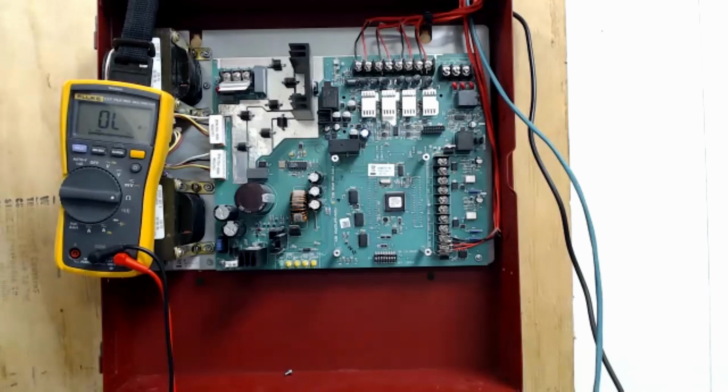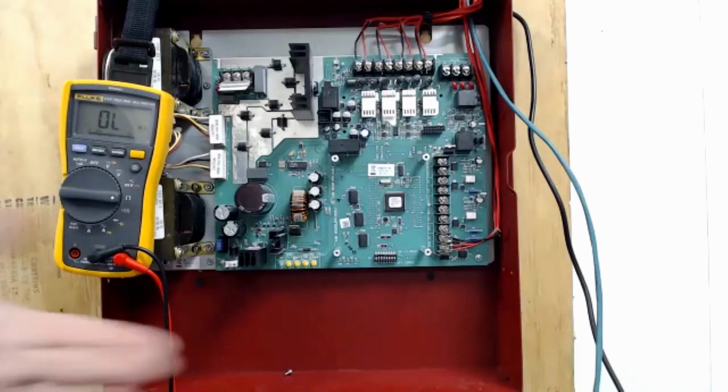Another note for dip switches: in order to get most panels, including this one, to accept any changes made on the dip switches, you actually have to power cycle the panel. So it's best to do it while the panel is turned off. Then you set your dip switches, and when you turn it on, it sees what the switch settings are and does whatever they say.